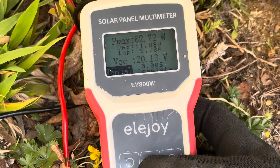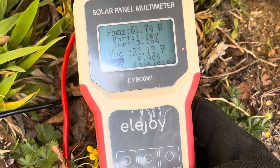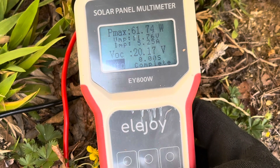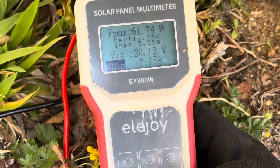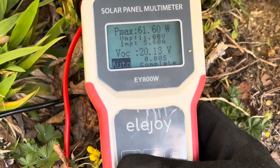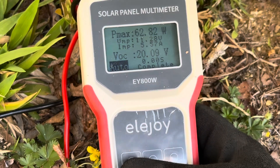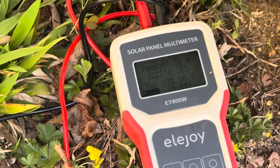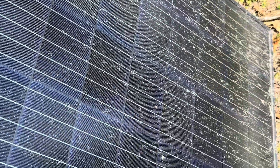Hitting auto track again — 61.74 watts. You can see the max power voltage is just terrible on this panel. So 62 watts out of a 150-watt panel — that one would be a fail if you were looking at it as a used panel.